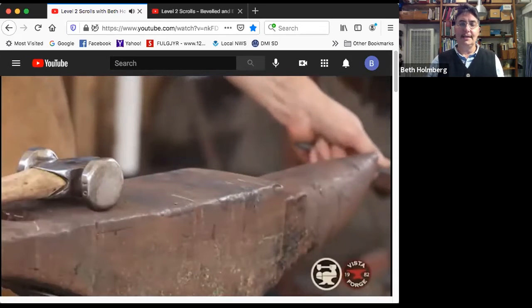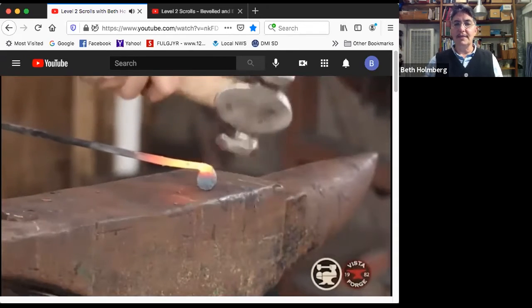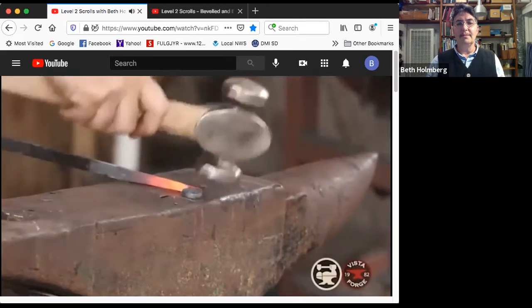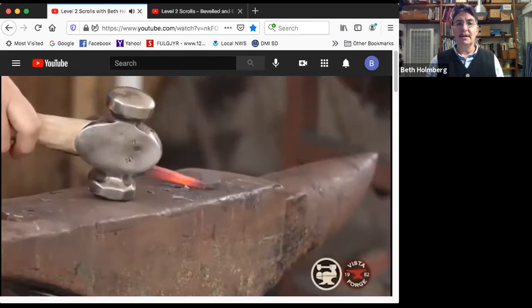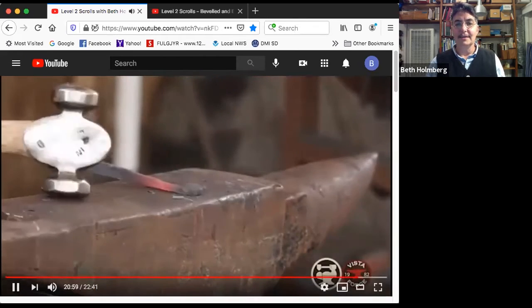So another heat, quenching the nice round stuff to protect it. Oh, nice. And then I can really work on that transition area, making sure I'm getting that lump out. Oh, it started to open a little bit. I got to close it just a bit so that I'm getting that nice eagle's beak. Still not quite there. And right there, I got it fixed. Yay.